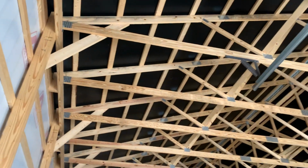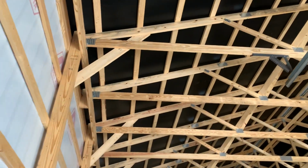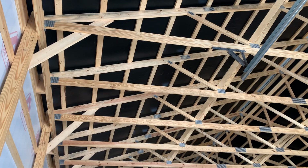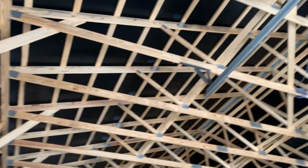All right, because you've probably been in buildings before, you're thinking, what's the leaks coming from? Well, if the purlins are on the edge, it just makes it a smaller area to drill down in. So that's one of the reasons. And we just think 4 foot on center, definitely more lumber, more wood, keeps the building stronger and so forth. So that kind of gives you an idea there.